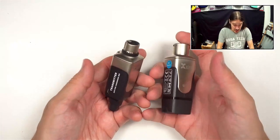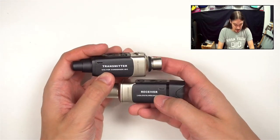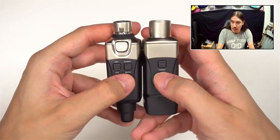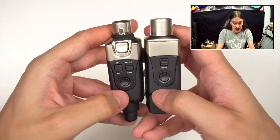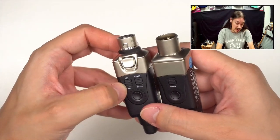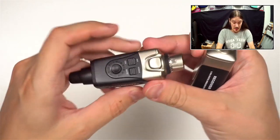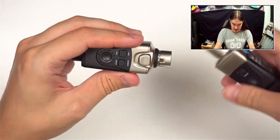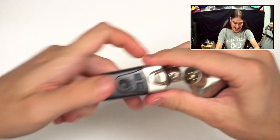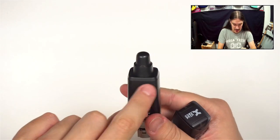Let's take a closer look. This unit looks just like the original U3. It has micro-USB connectors for charging or possible firmware updates. On the other side are controls, power switches on both units, channel selector buttons, and the transmitter also has a voltage switch from 12 volts to 48. There is also a lock button — it locks inside a microphone as you plug it in, just to be sure it's really plugged in because it's really tight. There's an antenna here, an antenna there, one LED here, and two more on this side.